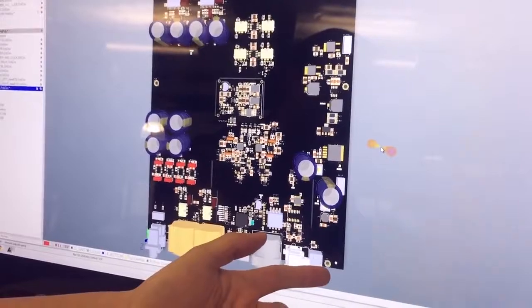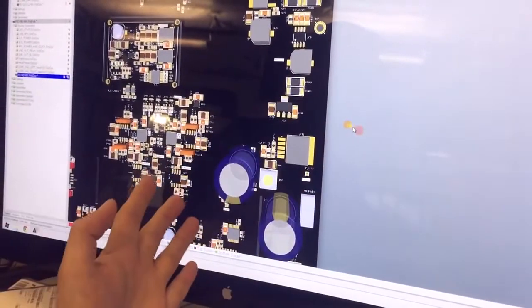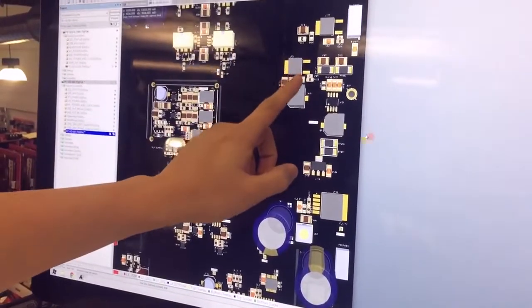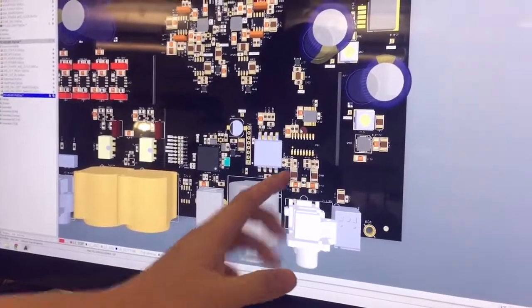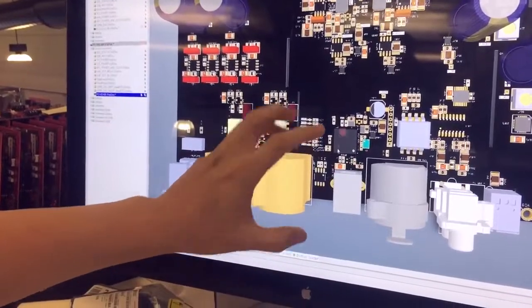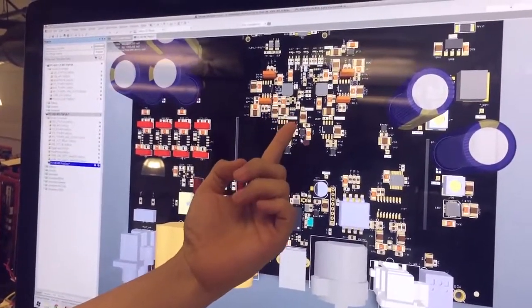For example, this one was originally the Geek Pulse power input, but now we don't need that external switch. We have the internal connector here and here that gets power from the other internal power supply board in the DAC. We still have a lot of local regulators. This section is the digital input part, the audio input, isolated in one part. This is the XMOS, and this is the USB. You can see this group binding together, and we feed it all the way up to the two new ESS DACs here.